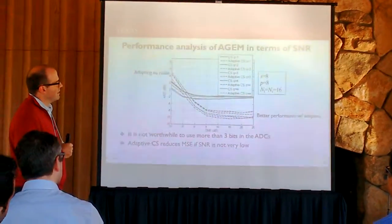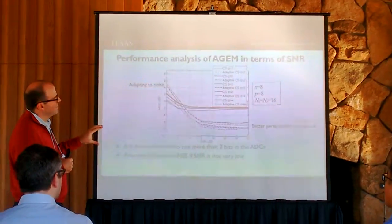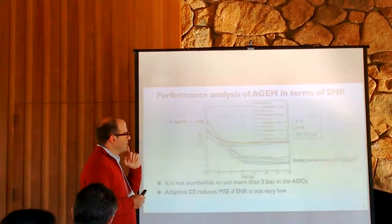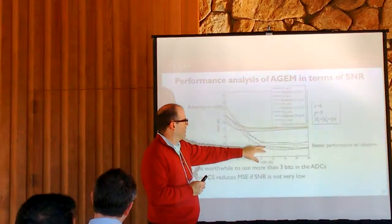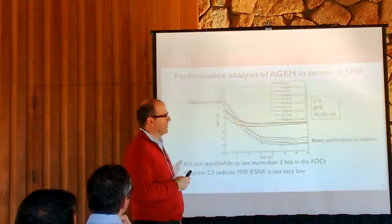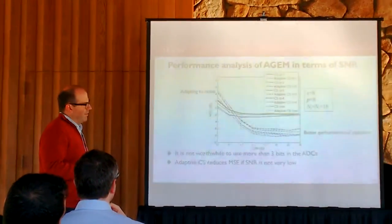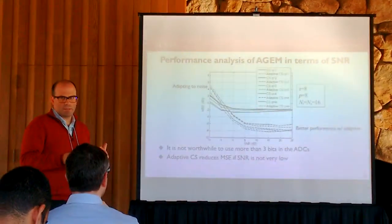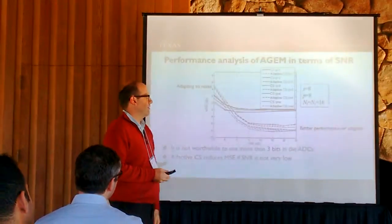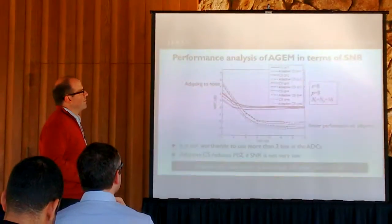The other thing to note here is that I was wrong about the Q. The Q is the number of bits. So Q is like 1 bit, 2 bit, 3 bit, 4 bit. And what you can also see here is that this is like infinite bits, and this is 1 bit. You can see the difference between 1 and infinity is less than 2 dB. So the penalty of having low-resolution ADCs in terms of channel estimation is very, very small. And that's also true in the non-adaptive case, it's even smaller there. So the fact that we're quantizing here is not hurting our channel estimate all that much.